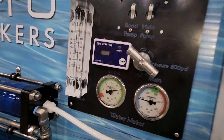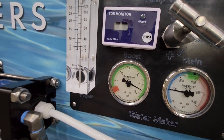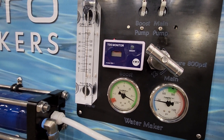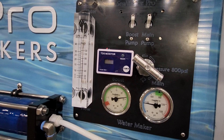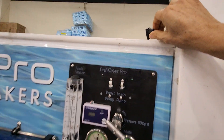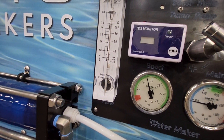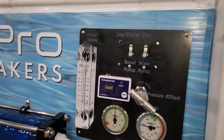If I turn it all the way up, we're going to get 25 to 30 psi. That's when both pumps are running. We don't care what this number is when only the boost pump is running — we care what this number is when both pumps are running. So I'm going to adjust the potentiometer and dial down to 15 psi, and then you should never have to adjust it again.